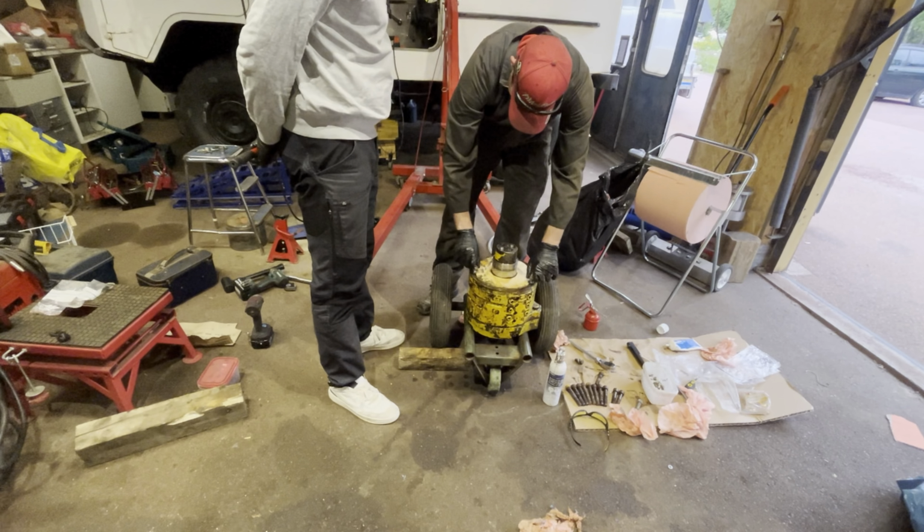So yesterday I stabbed this slew motor back in position, and surprisingly it just fell in there. I clocked it to the central position and the digger arm straight forward, and somehow I didn't have to use violence to get it there, so that's nice. I have tried it and it actually works. So we did the seal surface on the shaft and no oil leaks yet. Doesn't leak from the bottom, doesn't leak from the top.